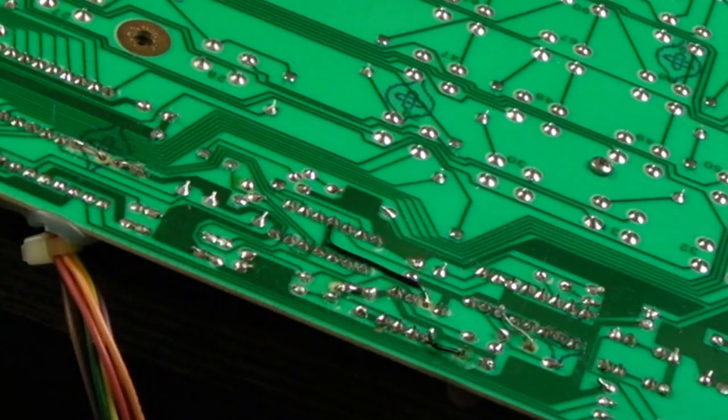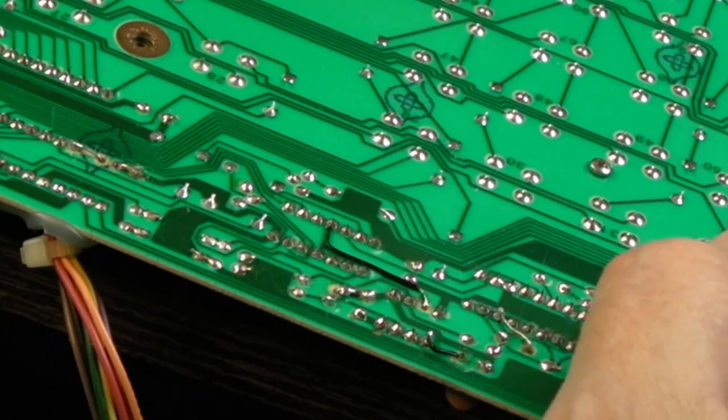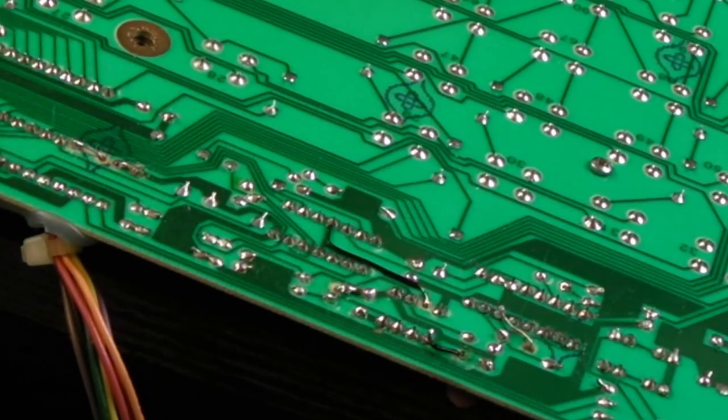So everything looks alright there now, but I also scratched in between it. There were a few pins where I'm like, is there a join there between those? And I just scratched, and there's like a particle of solder between them. And there were 3 of those, 3 particles I found between things, including over here on this.